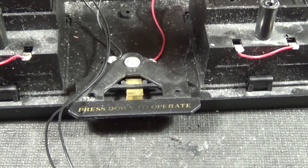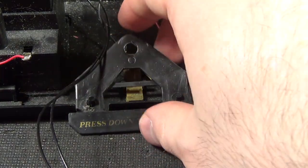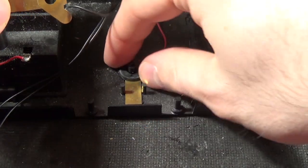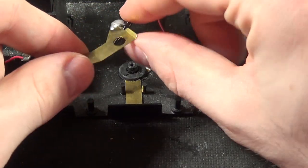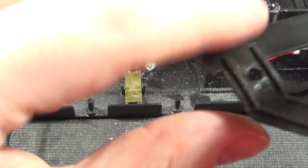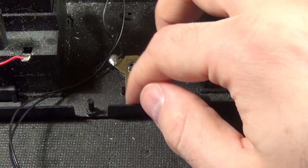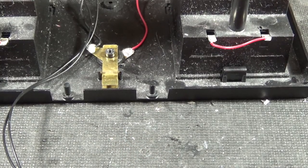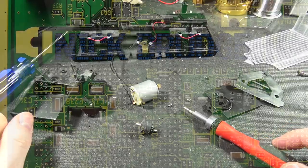The last thing to do is look at that little contact under there. I wouldn't expect you'd have to clean it — there's not much arcing at six volts. There's a flat bar on the bottom, a little spacer, and this is bent ever so slightly upward so that it stays separate, held down at the top. You're just pushing those two bits together, which is really all a switch is — two contacts making contact. You can see the batteries are jumpered across. I think that just about sums up what's inside there and a basic look at how it works. Thanks for watching and I'll see you next time.